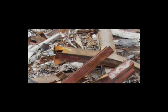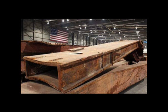I'd like to get a closer look at that. It's sometimes difficult to tell from photographs, but if we can actually see that column, we can learn much more. But what you see is a thermal event, and you see the particular kind of failure that we would expect. As regards the opposite concave faces, again, we see exactly that. One of them pushed inwards by the concussion of the explosion, and the other pushed inwards by the weld as it's been torn across. So what we see is exactly the kind of failure that we would expect to see.